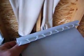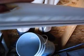And as I said before, this here is just eaves trough stuff, and I'll just show it to you here in a second. Over here, this is the material right there, just eaves trough material. You can see how that would click into your eaves trough like that. All I did is cut those fingers off and stacked it consecutively in a row, and then I screwed it together right there with some pan heads and just some small ones, and glued it together with some contact cement, and it's been working really well.